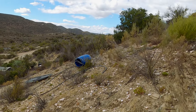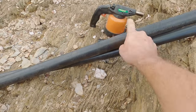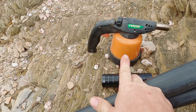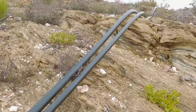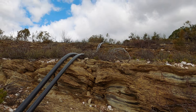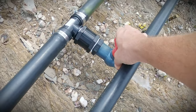Over there is the location of the container. I need to supply that with water from our main line here — the 40mm is the main and the 32mm is an overflow. I'm going to be inserting a 40-to-20mm tee piece into the 40mm here, and to do that we need to go up to the water tank and quickly turn off the main so that we don't flood out this place and waste water.